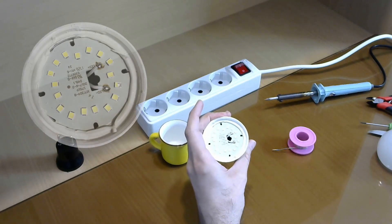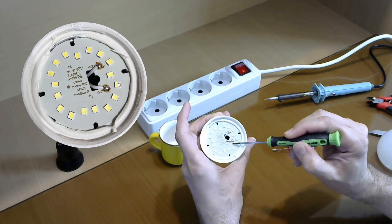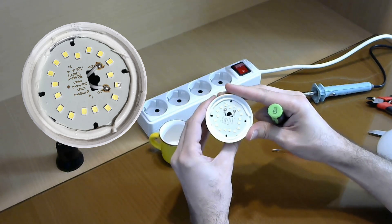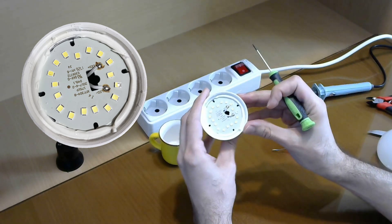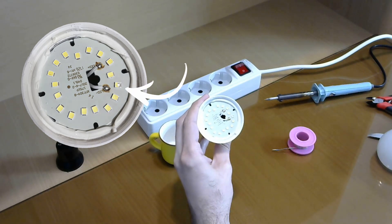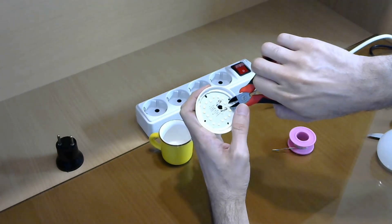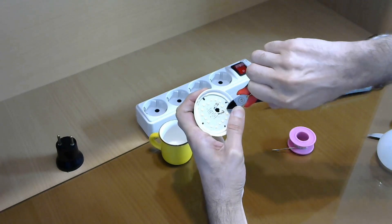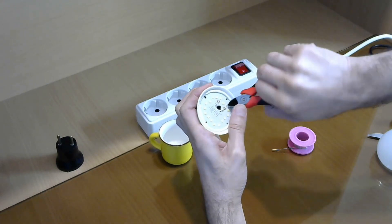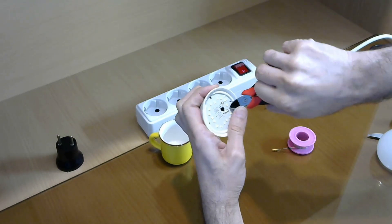The LEDs are in here. They are in a chain, as I told you. You need to search for an LED with a black dot. I can spot it very easily — here it is. I first remove it, and then, to fill up the gap that it has created, I solder it.